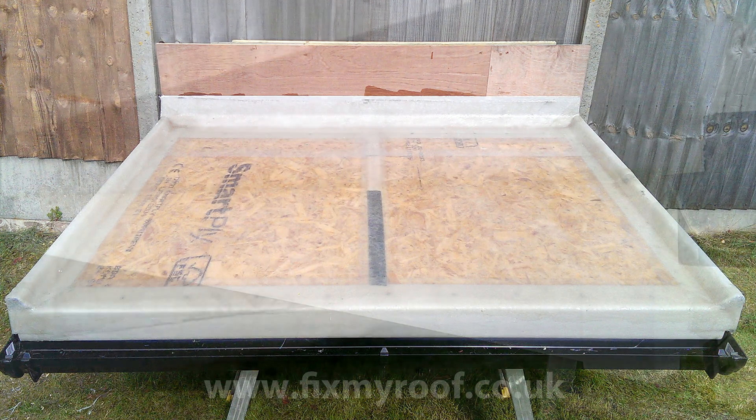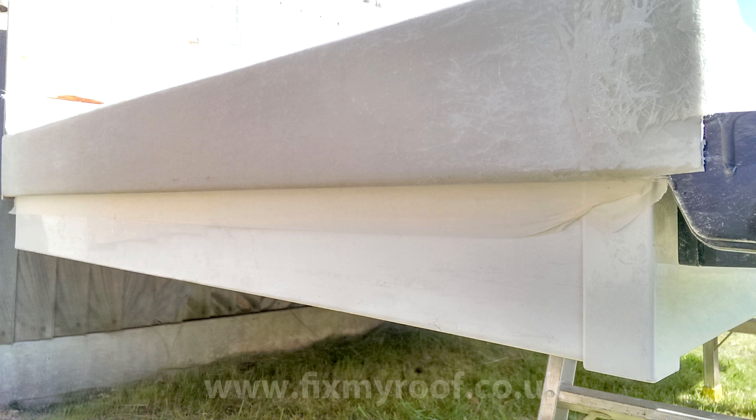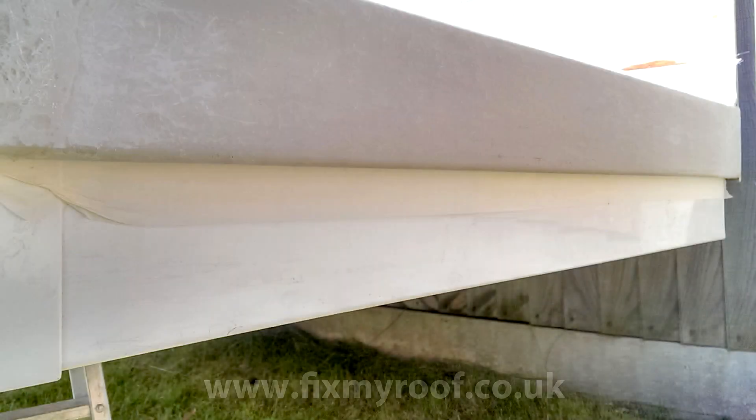But this roof really doesn't need any of that, so I'm going to prepare it for the top coat. If we just move the camera underneath the side trims for a moment, you can see I've already slipped some masking tape under the bottom and onto the fascia. This means a lot less faffing around later on and I can work faster when cutting in. And obviously I've already done the same for the other side, so it's now time to do a top coat mix.